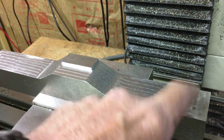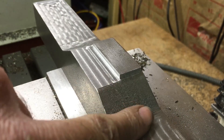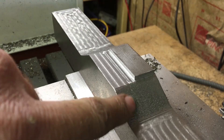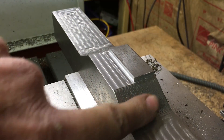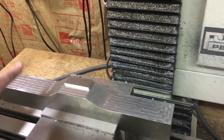The roughing is all done. I still have to do the holes and the counter bores. Normally at this point you would do a finishing pass with a ball nose end mill, but this is just for bending brackets, so I filed it down a little bit so it's not too rough and I'm just going to leave it like that. I'm ready to start making the counter bores.